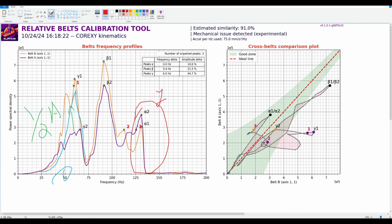I'm going to start looking at, for this one, do I get 125 hertz in my Y input shaper? If I get it in my Y input shaper, it's going to be a tap. Something hitting the tool head. So tap, or let's see if I can write here, cable chains hitting the tool head. Something like that is what I'm looking for.